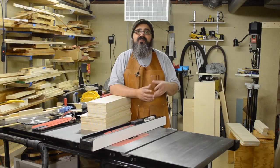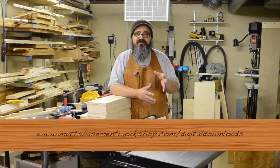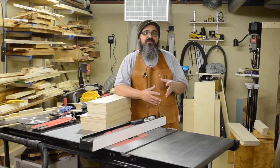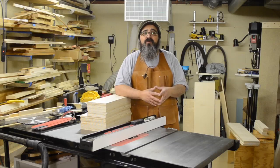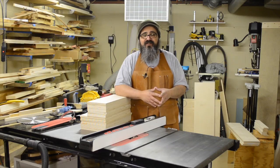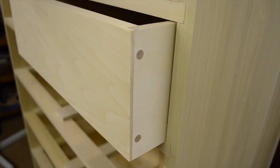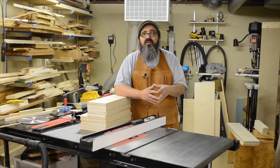If you are following along, if you've purchased the plans or seen some of the sneak peeks available at MatsBasementWorkshop.com slash digital downloads, you've noticed that the drawings actually show a dovetailed drawer box. It's a great option that I highly suggest. But what you're going to see me do today are not the dovetails. What we're going to do instead is a rabbeted joint, and then reinforce that rabbet with some dowels — a really beautiful and very strong joint that will work perfectly for the tall dresser.